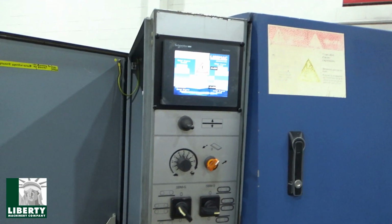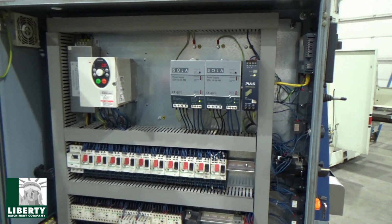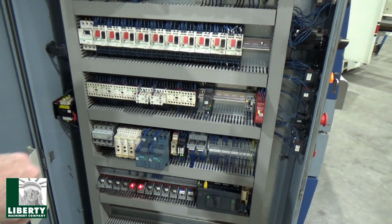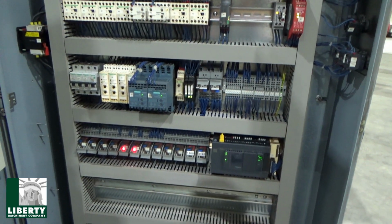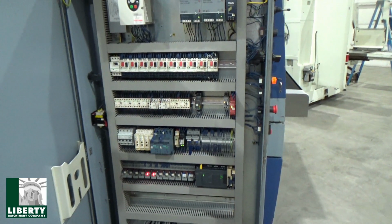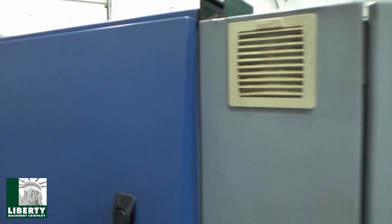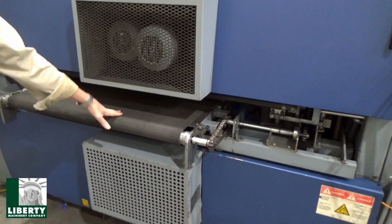So you come around to the main panel. Power supply is up high. That's the conveyor. Frequency drive, the Toshiba. All the soft starts for the motors are down here. And there's the new Schneider PLC that we just put in. Down low, and all the relays. Currently 480 coming in on the floor. That's my temp cord coming in, 3-phase. Got the old 3-phase here for the mist collector and conveyor on the back side coming off.